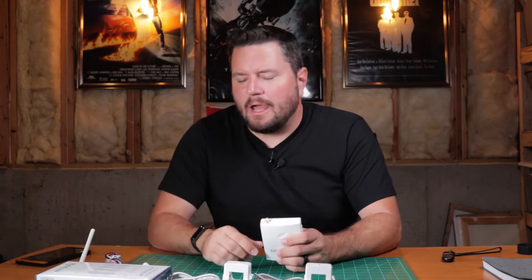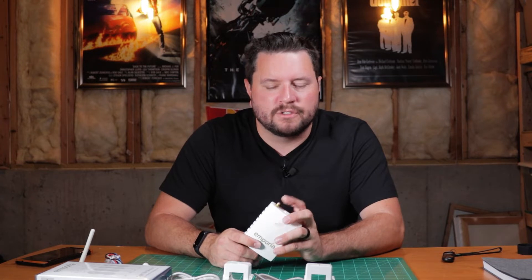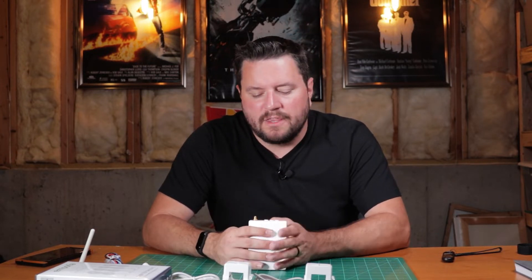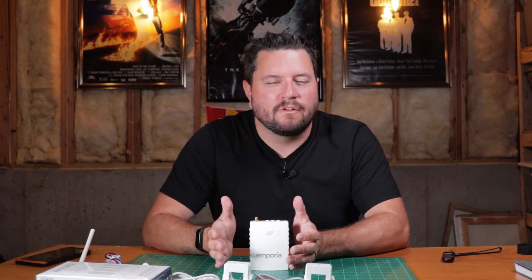These are rated at 200 amps incoming, and each of the smaller CTs are rated at 50 amps. The sensor connects over Wi-Fi to their cloud app to upload data. It does have onboard storage in case you lose internet connection — it can store one-second resolution data up to three hours onboard, one-minute resolution up to seven days, and one-hour resolution data indefinitely. So depending on how long the system is disconnected, it can store data at varying resolutions. You'll never lose all the data, but you might lose some higher-resolution data if you care about one-second intervals.